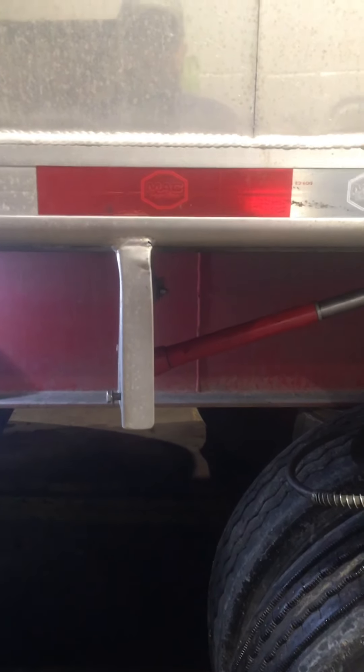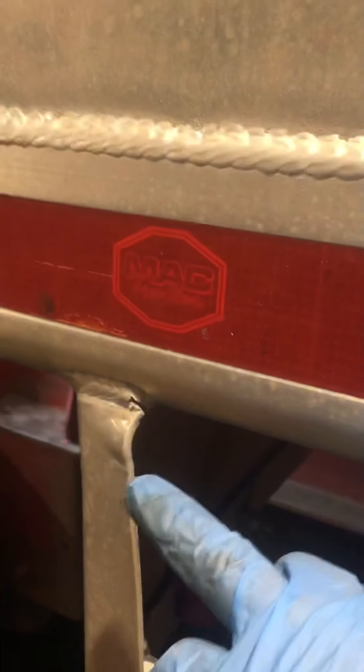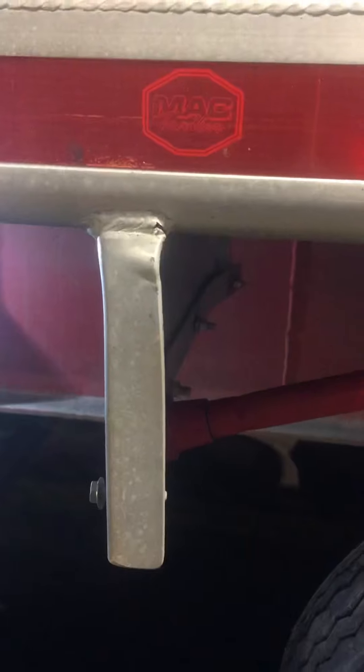So I've got the outside edge back to where it's about square with the body. There's a little spot up top here - I'm not going to touch it because it's hot as heck. But right here it's bulged out a little. So what I'm going to do is as that cools I'm going to ever so slightly tap that with a hammer - go gently and take your time, and you can almost tap that right back into place. I may have to put just a little spot of weld on the end here, but that can be done after. Along that bottom edge is quite wavy; I'm going to try and straighten that out some if I can.